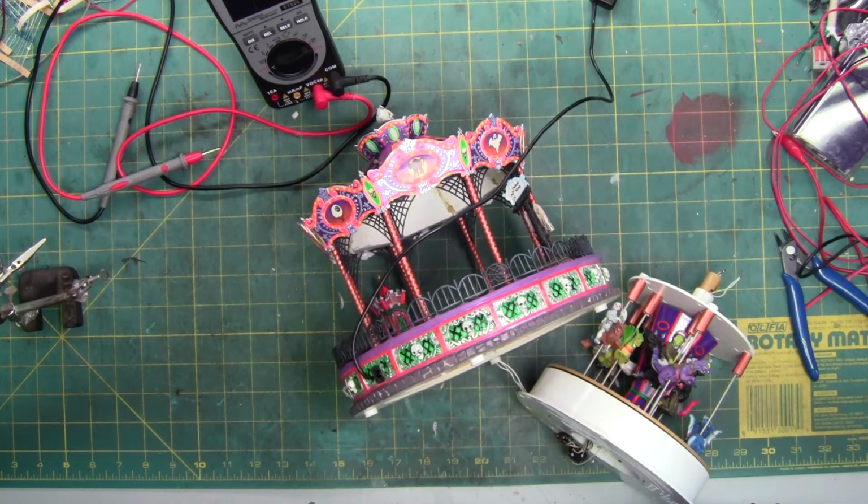But anyhow, there's a lot of burnt stuff, and I'm afraid to energize the circuit because if anything is too horrible and that main blob chip gets fried, the one down here, this unit's useless. So I'm going to try and trace all the wires, trace the 3 circuit boards, figure out what everything does, try and isolate what each of the burnt resistors go to to determine why they're burnt. Resistors only usually burn when you overcurrent them. This is only 4.5 volts.